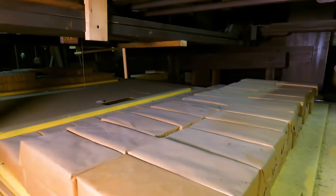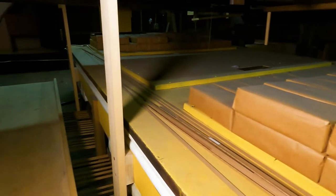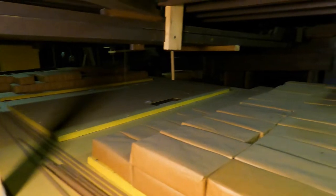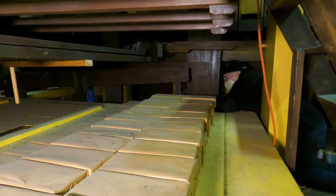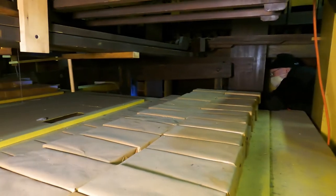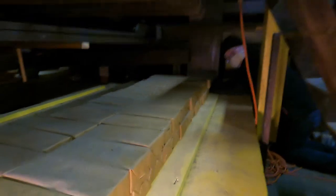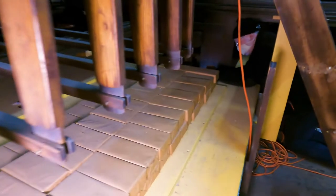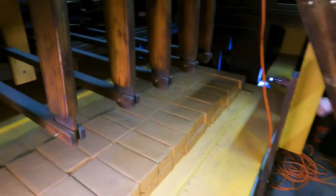This one looks an awful lot like the stuff that was around in the early 1970s. The stuff that goes dry rot like that? Oh, yeah. They did that in the 90s, too. Yeah, well, in the 70s, it was worse. Even Casavant had to start doing swimmers and reservoirs for their organ in rubber cloth. Oh, really? Even the gussets? Wow. I didn't think you could put a gusset with rubber cloth. Well, you can. You just can't stretch it. You have to cut it.